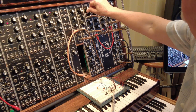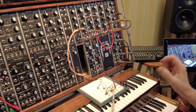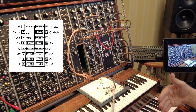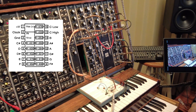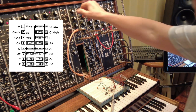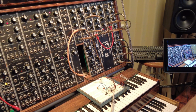Hey guys, this is just a quick video to show you a little project I've been working on. One of the organ companies used something called a top octave synthesizer — a divider chip that you put a pretty high frequency into and it gives you all of the notes of an octave. It would be the top octave only, and then you would use successive divider chips to create all the lower octaves.